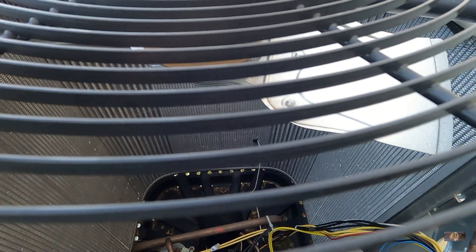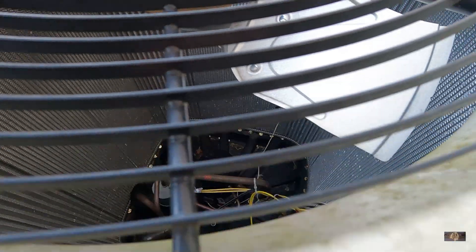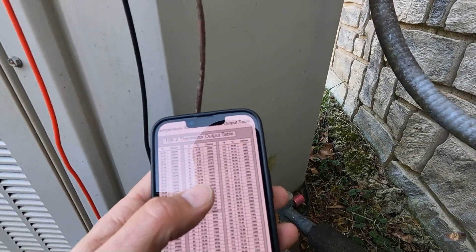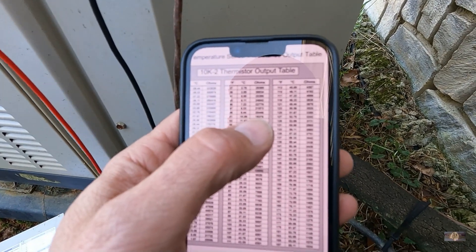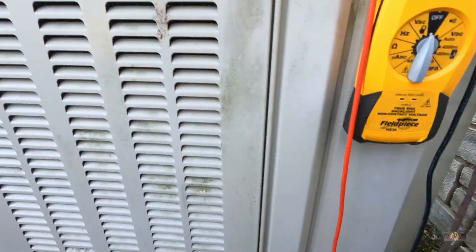The outdoor coil is micro-channel as well, so it's got one of those little sensors that sits down in the coil — you can see the white wires right there. I don't see that it would be rubbing on anything. The zip ties are intact; it goes under the suction line of the compressor, up through that zip tie, with no potential to rub. I'm reading high resistance. If this is a 10K ohm thermistor, I should be at a lot lower resistance. It's 50–51 degrees outside, so I should be reading right around 19,376 ohms — and I'm reading 34.